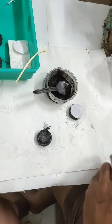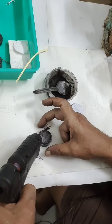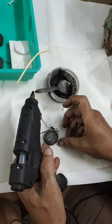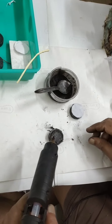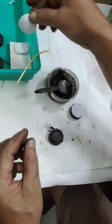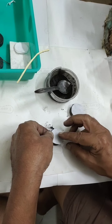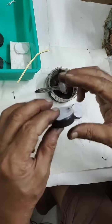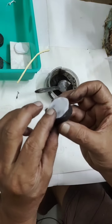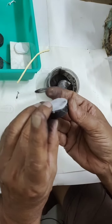So we have now filled it. Again I am going to surround it with the hot glue. Just after applying all this, I have already made a pre-cut of this polyester film — it is just a filter. Above that I am going to place it to close it. I press it for evenness. The carbon particles are inside it, so this becomes the positive electrode. The negative will be just plain carbon electrodes.